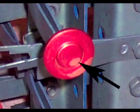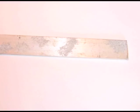The most important part of the anodizing process is the surface preparation. Poor surface preparation will show up immediately if dyeing the part, as the dye will look patchy. Even fingerprints will cause major problems.